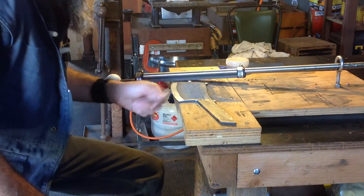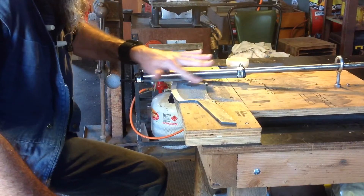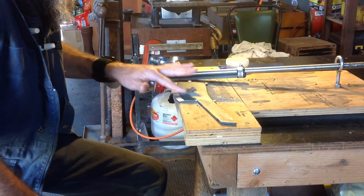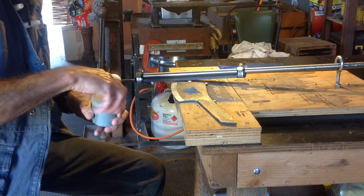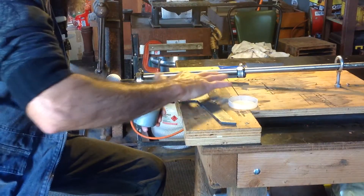A bit funny — first time I've done a big bit of saw blade. I annealed it a couple of nights ago, and I do find occasionally that you will feel some soft and hard spots. I don't think that's too much of a problem — I'll be doing a normalising three times before you do any heat treating.